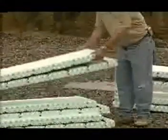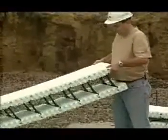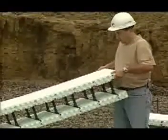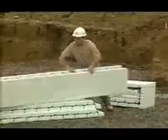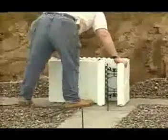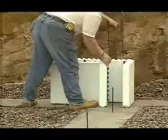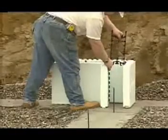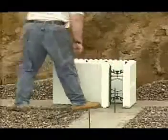The forms are easy to open. Hold the form so that the long end is at the bottom and brace it against your stomach. Pull the upper section towards you and the form is ready. Opening a corner form is similar — the only difference is you have to remove and reinsert the web on the short end of the corner. Do not forget to reinsert the web or the form will be significantly weakened.